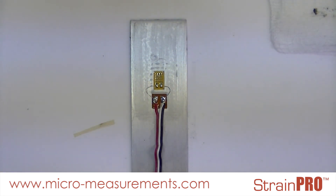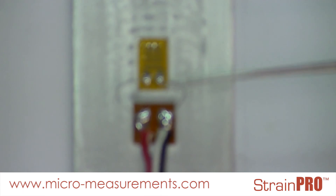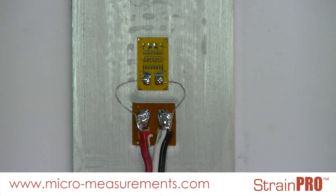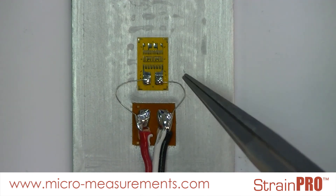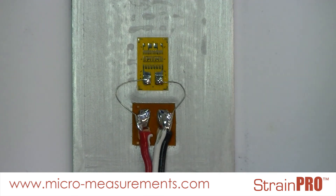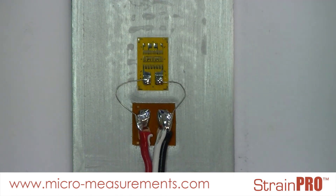Thank you for watching. Best of luck with your testing. I have some questions about the installation here — I noticed that the solder connections are extremely small. Can you describe the reasoning and how this helps in fatigue applications? As you can see, I've extended the wire out of my bondable terminal — the anchor point for our larger lead wires — and ran the wires out into the sides of the strain gauge. This way the wire is not pulling directly on the solder tab and there will be less stress on the tab itself. Reducing the size of the solder dot helps reduce mass and the amount of mass pulling on your solder dot. Because copper wire fatigues very quickly, in this arrangement you've decoupled it from the strain so there's less strain on the copper wire itself and less chance of it failing in fatigue. Most definitely.